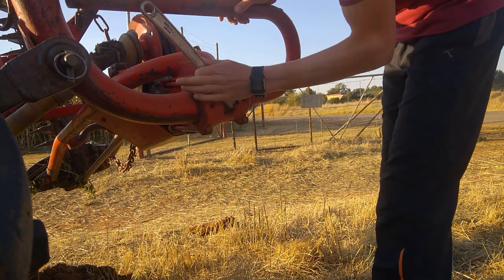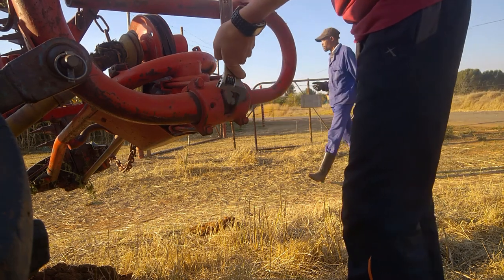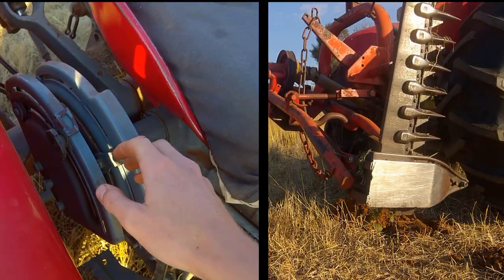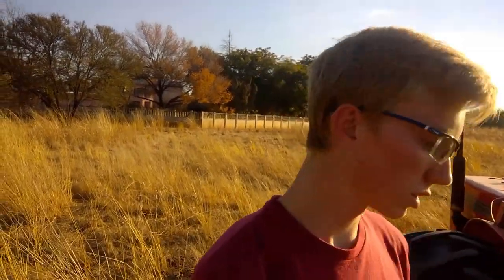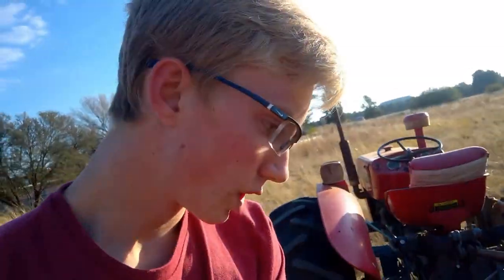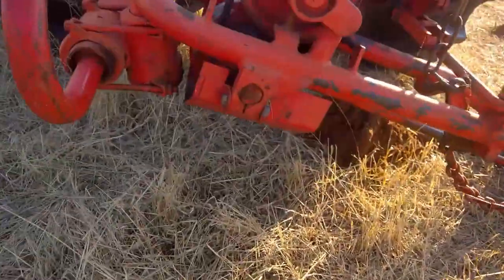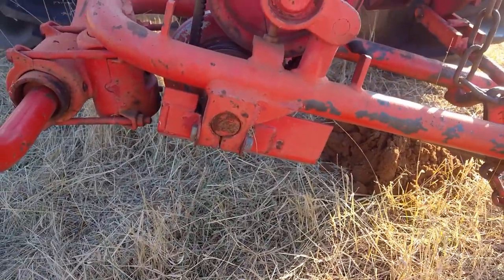You have to tighten this bolt quite a bit. One thing I can show you is this chain that I made, how it works. I've adjusted it so that it's tight at this height with a bolt. It's just enough to give clearance between the grass and this pan protector here at the bottom, and we're going to move on to lowering the blade section here.